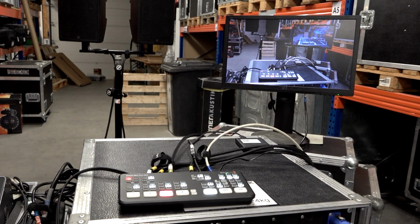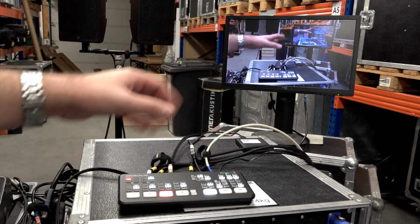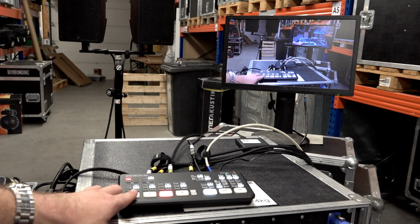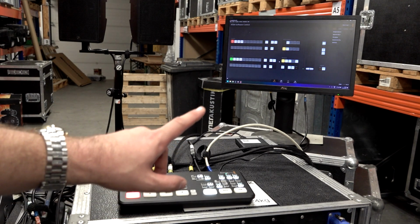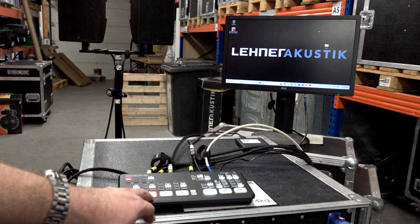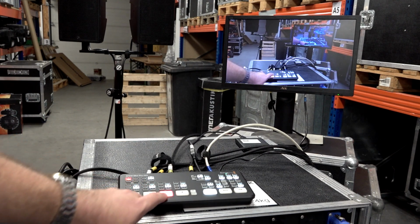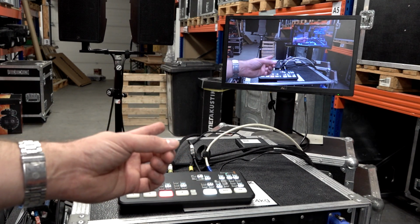And this is the Blackmagic I am referring to, called the Atem Mini Pro. We have one output source, which is the main screen as you can see, and we have 3 input sources: laptop 1, laptop 2, and our streaming camera. When you set up, make sure the resolution and the aspect ratio is the same for all devices. In the software provided by Blackmagic, you can change the different features, such as fade length or layering different displays on top of each other.